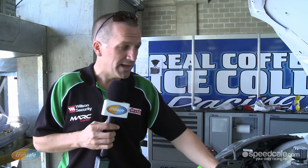We control them completely, all the quad cams and electric throttle, with the latest Motec M1 engine management system, which we dyno and tune in-house on the Gold Coast at Norwell. So the engines are largely untouched. We changed the pistons and the conrods just to get the service mileage of the engine up. The idea is that it's a 500 horsepower engine that will do two 24-hour races, so roughly 8,000 k's before it needs a major teardown.